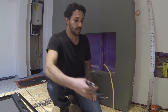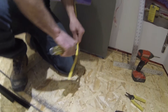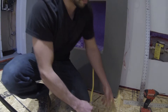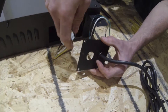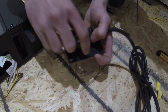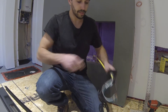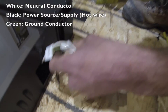You don't have to use 12-2 — you can use 14-2 wire. I'm just going to strip this and cut it in. The electrical plate is just four screws that you take off, and then you can put a cable connector — I call them a 30-30 — there. Even though I'm going to be hardwiring it, I'll still leave the cord in there and have it hidden. It's pretty simple: white to white, black to black, and ground to ground.